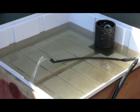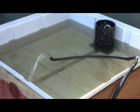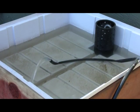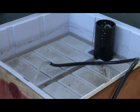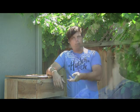So you put a 2 gallon per minute pump in there. Well, the siphon can pull out 4 gallons per minute. So when the siphon comes up and starts, it'll then pull it out twice as fast as it is filling. Then the siphon breaks because of that little tube, and then fills up the tank again.